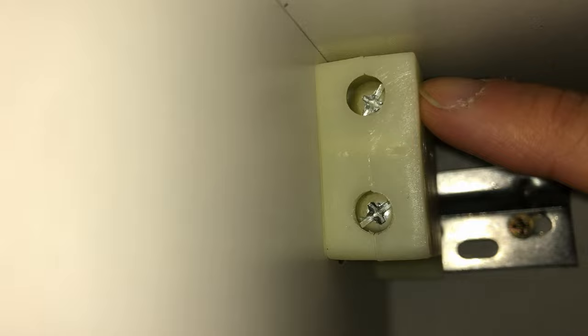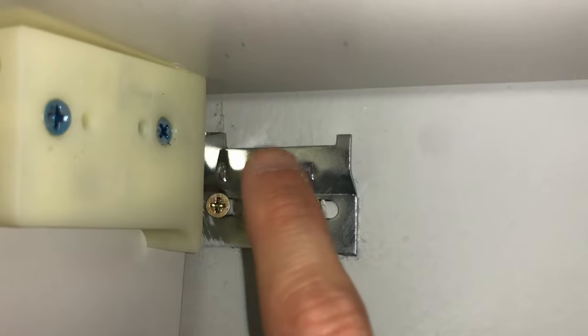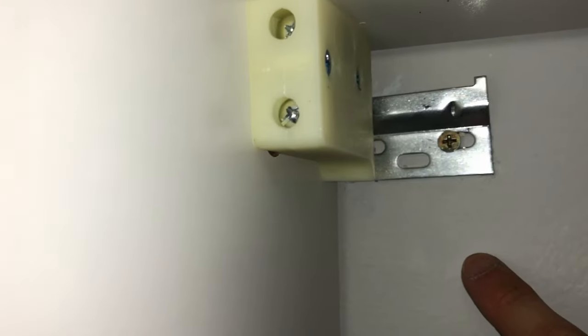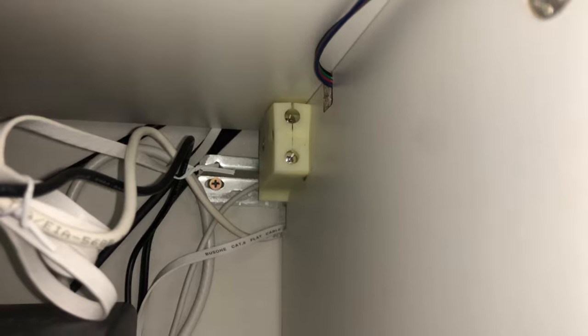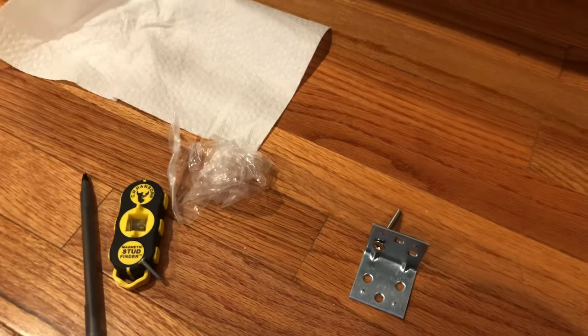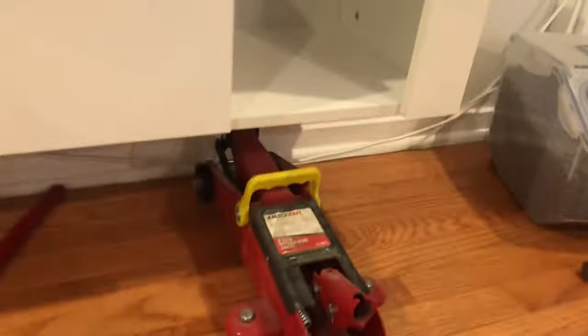In my case, I was lucky — three out of the four mounts went into solid wood. The wall brackets are fine, but the clip holders aren't very good quality. Each has two screws: the bottom one extends the clip in and out, which helps you get the stand seated onto the wall brackets when fully extended. Once seated, you can tighten the same screw to pull the unit closer to the wall for that flush look. The screw on top fine-tunes the level left to right, but it doesn't go far in before the two plastic halves start separating, as you can see here. Get your measurements right in the first place so the stand is level to begin with. These screws are in tight, cramped locations where your hands and screwdrivers won't easily fit. I gave up on them and just ended up using some corner brackets while leveling the stand with a trolley jack.